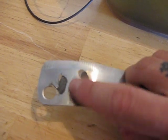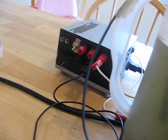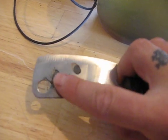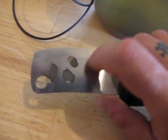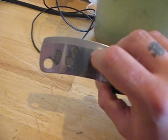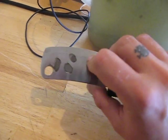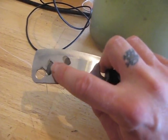If you like that texture you can keep it — it gives a good contrast on the piece. You can also use an AC supply; this supply is DC, but if you switch over to alternating current after the etch is done, the surface will turn black because it basically strips and then replates material very fast. That gives you a very dark surface for high contrast. Alternatively, you could sand and polish it to get a nice defined edge around the etched area.